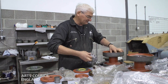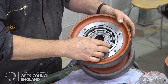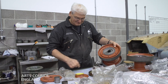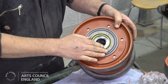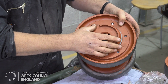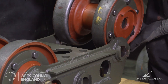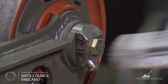That then fits into the assembly like so. The labyrinth seal goes on there and it's bolted up and then wire-locked. The oil seal goes in, then the last part goes in as a press fit - we do that on final assembly as you need to lubricate it. That will then go in and is retained by the bracket on the bogie assembly. That's one roller assembly complete, and we've got to do 20 of those.